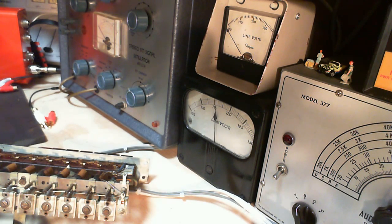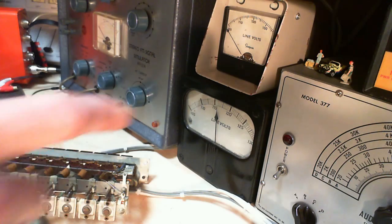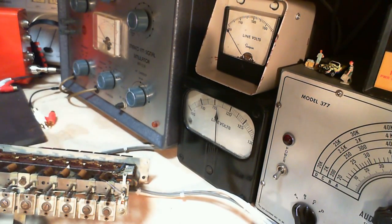Not swinging quite as wildly. See, look at that. See, that doesn't say to me that's loads in people's homes. Wow. The way these meters normally move, because I used to work for the power company, is you turn on a load, you turn off a load. The change persists. You don't turn on a load and turn it off right away. You don't get jerky flying movements on these meters. They should go up to a spot and sit there, and then down to a spot and sit there. And they flitter around a bit. It makes me think there's some kind of contact problem.